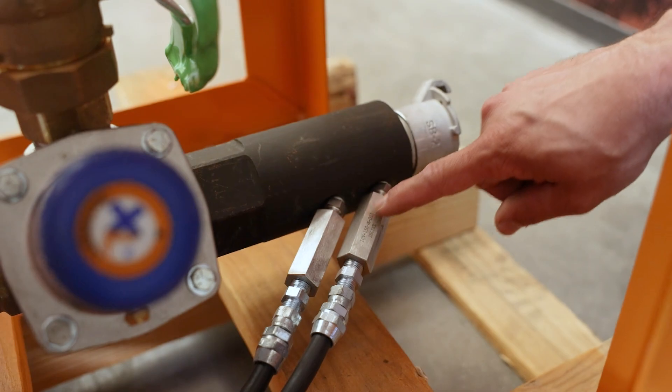In other words, you're not filling your pot with water. This design requires much less water consumption than a slurry blaster, with precision metering technology allowing you to dial down water consumption to as little as a half pint per minute.